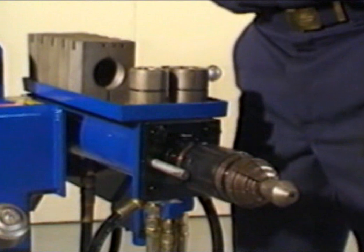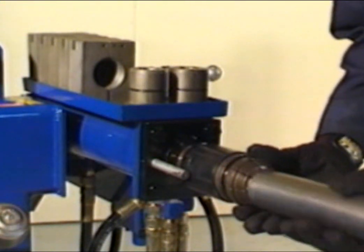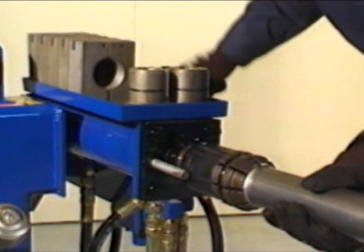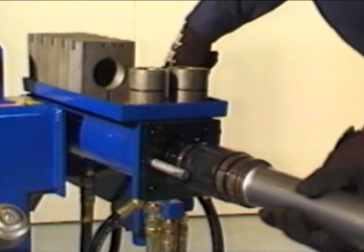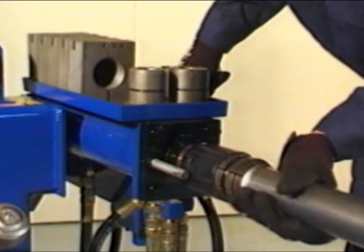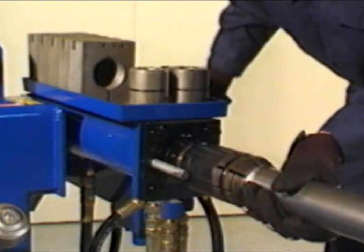Adjust the buttress canister until the grooved line on the canister is lined up with the grooved line on the pointer. Then center the X symbol on top. To make a flare expansion, place the tubing over the segment expander until the tubing is positioned midway over the stepped ridges. Tap the control handle down until the tubing begins to expand. Release and rotate the tubing and repeat until the desired flare is produced.